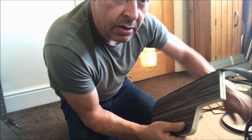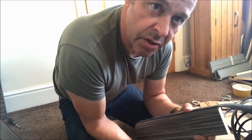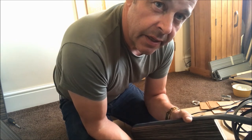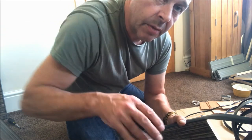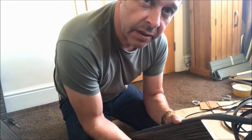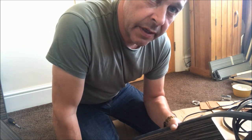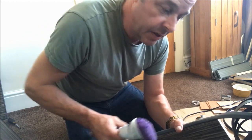It's all attached. I do that so I don't waste any. Some of the bits you maybe have to measure a little bit and cut before you start putting them in — especially on the little shelf things on the side of the cupboard, which were an optional extra. They're quite tight to get the edge trim in, so you might have to use a smaller hammer or something you can fit in there to get it in, because there isn't enough room to give it a good swing.